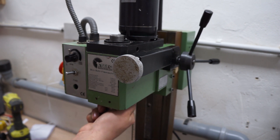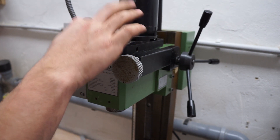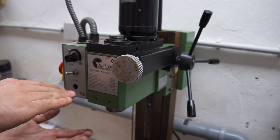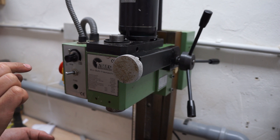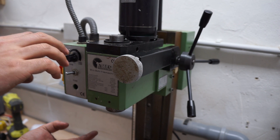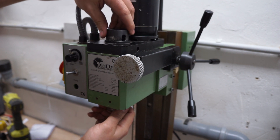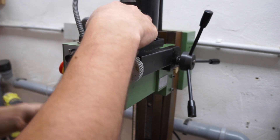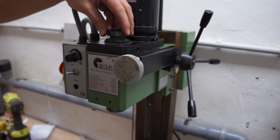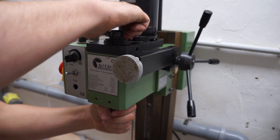I had my doubts, or at least my worries. But that actually feels very good and there is no up and down play. Still, we have to adjust the tension on these roller bearings because I need a very specific amount of preload where it's tight enough so there's no movement, but not too tight where there is too much friction and they heat up. So I'm going to put the sleeve back on again. Also, I shortened the key — I just shortened it by about two or three millimeters. Now we can tension it with this nut and this left-handed thread.